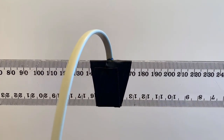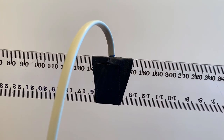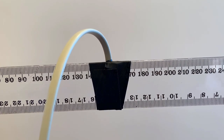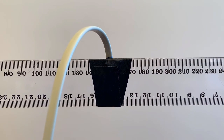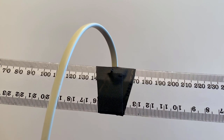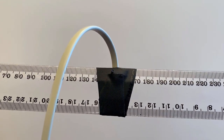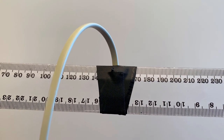Now I focus on the rear side of the sensor. I point the rear side of the sensor vertically and search around until SarkTrack stops beeping. This is point number five complete. Next, I point the rear side north at my local magnetic inclination and search around again until SarkTrack stops beeping. This is point number six complete.